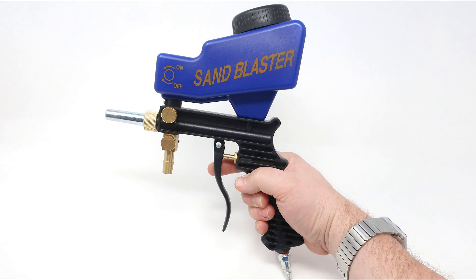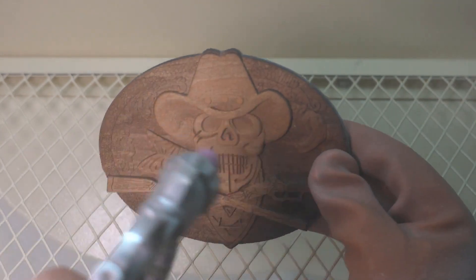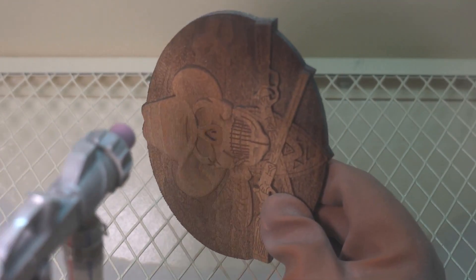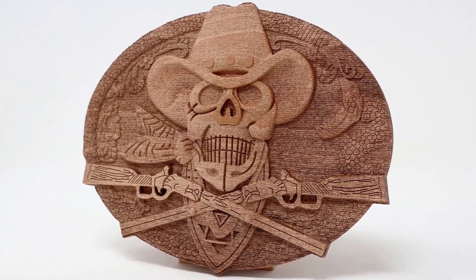However there is a solution. Using an inexpensive sandblaster in place of water, we can directly sandblast the surface of our material, removing the residue quickly and easily. By adjusting our air pressure, this becomes a highly effective method to remove smoke and heat staining while also ensuring that our engraving remains clear and undamaged. As you can see, we simply move the sandblaster across the surface of our piece and within seconds any residue has been removed.